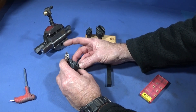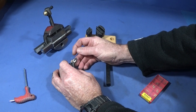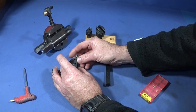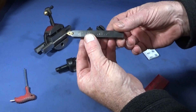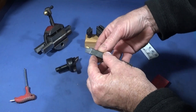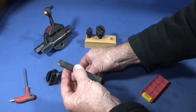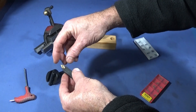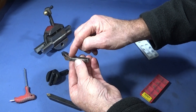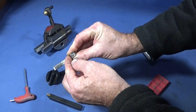I can use the fly cutter on both lathes, and because of the common insert type, I have plenty of tips and can change the insert when it wears out rather than having to sharpen up HSS tooling. To make this tool, I got one of these tools and cut off the end — it was a smaller one, I think a 10 or 12 millimeter one. I sawed off the end at an angle, then got a piece of eight millimeter square steel and brazed it onto the end.